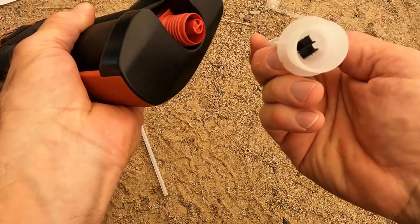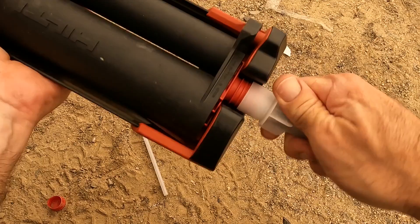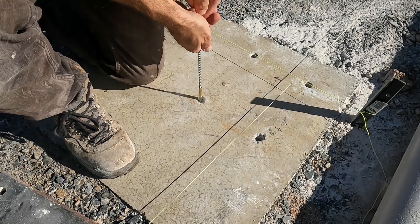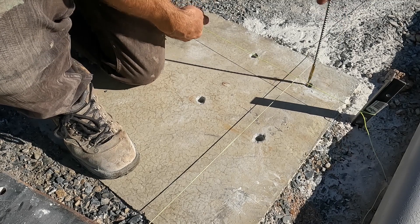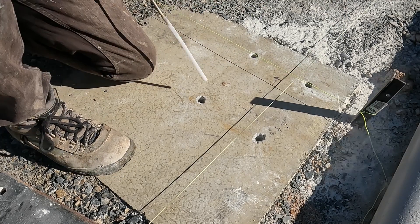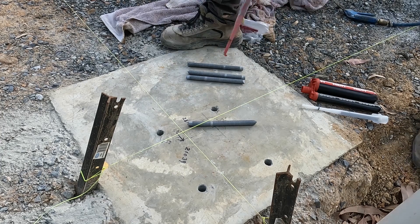For this job I needed about six, nearly seven of those 500ml tubes — they're not cheap. The main thing is to do it properly, get a good plan, and you'll be fine. You also have to wire brush the holes out. I wasn't sure how much extra dust was going to come out, but I was surprised at how much extra dust I got from the proper Hilti wire brush — and that's obviously going to help form a much stronger bond.